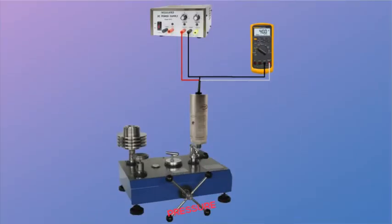First, the pressure transmitter is plumbed in line to the pressure source and standard. Using a deadweight tester, the unit under test would be plumbed into the output pressure line as shown.